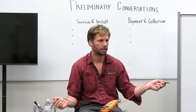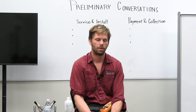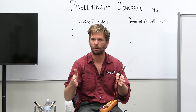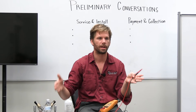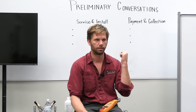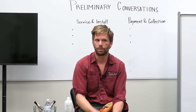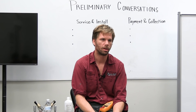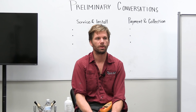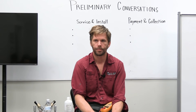Where's the first point that your equipment ties into to get electricity? If you're talking about a motor, contactor, or something like that, you have your equipment that is the load, and then you have your wires that come off of that and connect to the point where they get their power from. Usually one side of a 240 motor is going to connect directly to power — some lug where multiple points of power come in — and it goes straight back to the breaker unbroken. The other side of your motor connects to some sort of switch: a blower relay, a relay built into a board, a contactor. If your motor's not running and you need to check 240, where should you put your meter? At the motor.